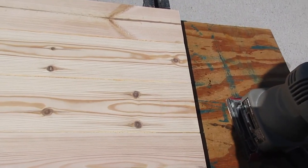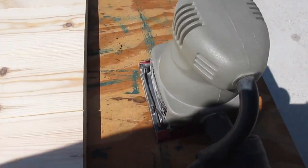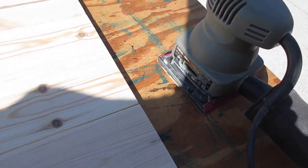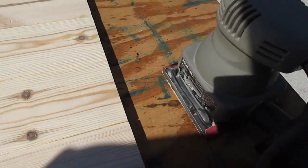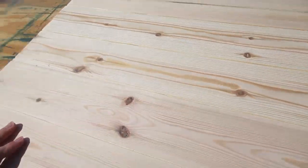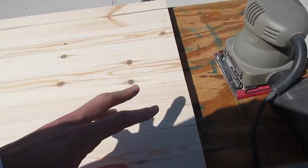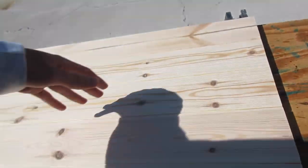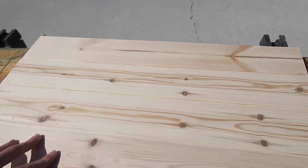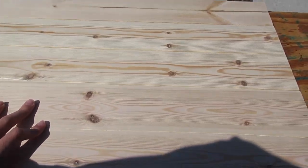Okay, it's a couple of days from the last time I filmed. It was really cold yesterday and a lot of stuff to do, so I didn't work on this any. So I need to finish sand this with this, pretty much just vibrate to 200 grit sandpaper. Just make it all smooth and nice and soft. And then I will glue the cross members on, and then I'll sand everything flush with those, make sure those are 90 degrees. I'll go in more depth about that when I do it. But I'm gonna sand this, and again, I won't show y'all because that's really boring to watch.